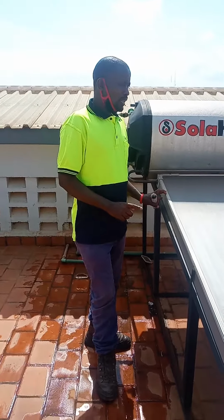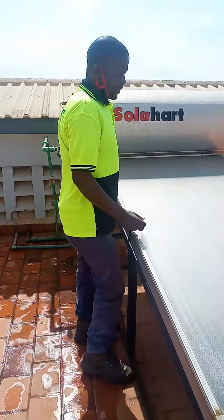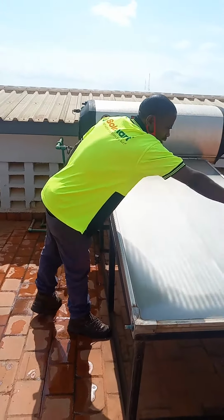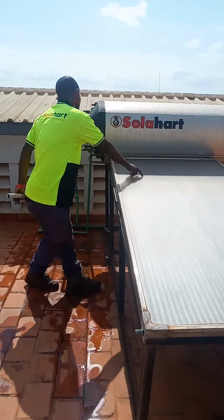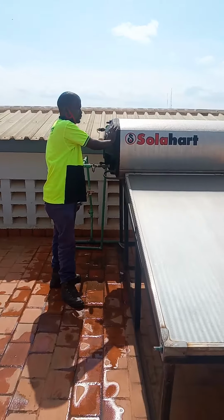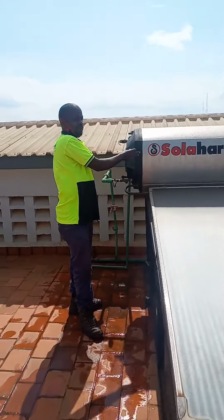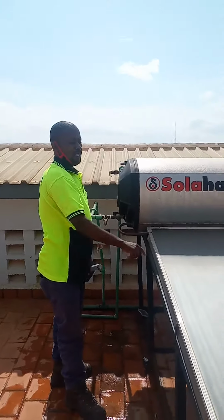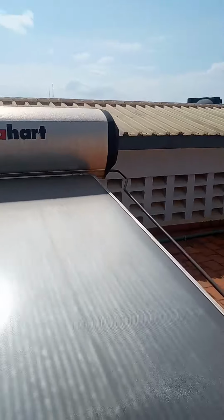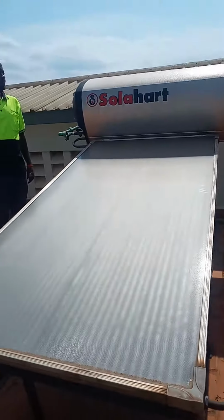The thermosiphon principle is that the fluid is moving from this side, comes through this way, comes here, comes through this jacket. When there is an exchange of heat, it goes back through the long pipe, which is called the L pipe. That process is why we call it a thermosiphon.